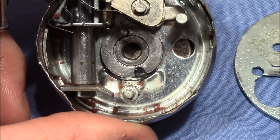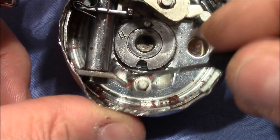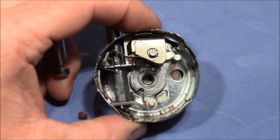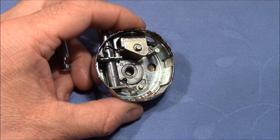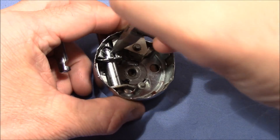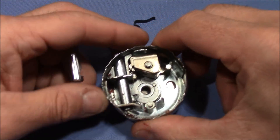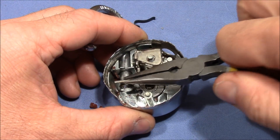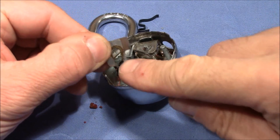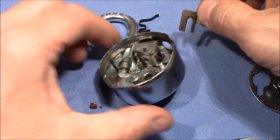Frankly, I have no idea. What is very strange is a lot of red powder — little red pieces — all the way around. I will now try to pull all the parts out of this lock and see if we can understand why it doesn't work anymore. So first I pull out this little spring here. Then we have the shackle that is not coming out because of this end piece here. When you pull out this end piece, the shackle should come out.